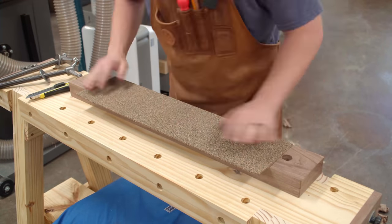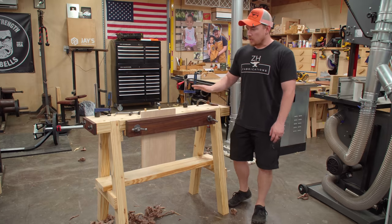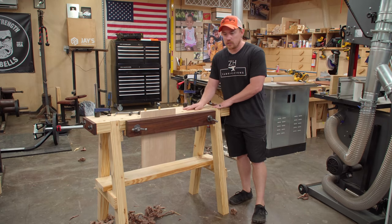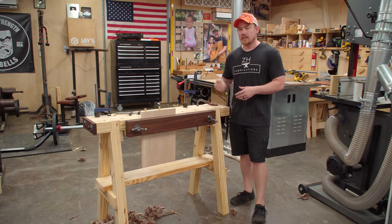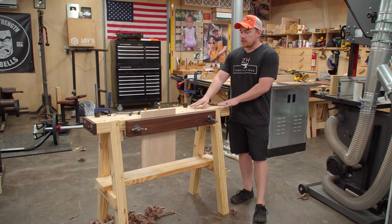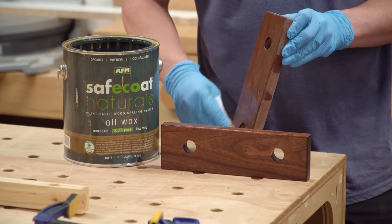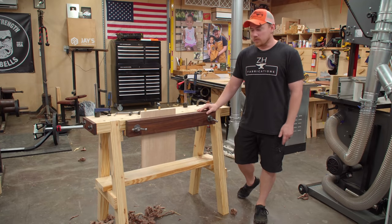Finally, a little sanding to remove all the pencil lines, and for added grip some cork rubber is added to the vise jaw. Do not add this to both sides of your vise — doing so will allow the workpiece to wiggle as there will be too much cushion. For all the pine surfaces I did not apply any finish at all, because I only want to apply finish to a shop working surface if I'm going to be doing glue ups on it — the finish helps glue pop off. In this case I don't see myself ever using this as a glue up station, so I prefer maximum friction with raw wood to raw wood. For the walnut pieces, however, I applied one coat of an oil-wax mix just to make it pop.